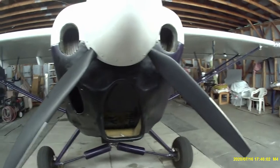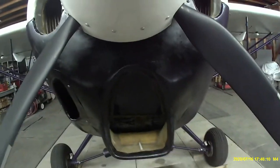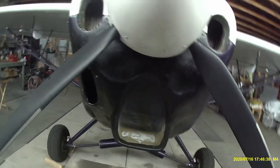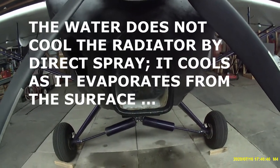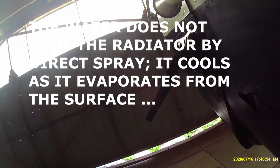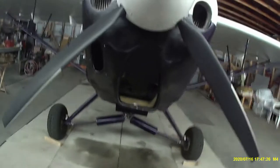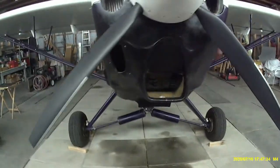If it's a really hot day and I want to climb in a hurry, that's my water spray — I'll turn that on now and you can have a look at what it does. There are two streams of water coming out of there — puts out a pretty good amount. Doesn't look like much but when you're doing 80 to 100 miles an hour on a climb, putting out that water and it gets onto the radiator, it does a super job. I activate that here — I've just got a switch on the panel. So my ace in the hole, my last resort, is to turn on that water spray on those few exceptionally warm days. I've still got that plan.